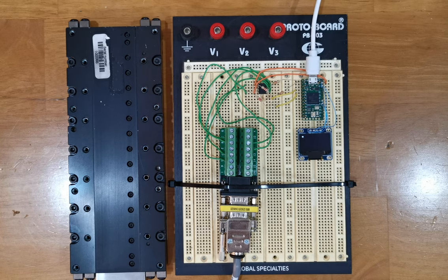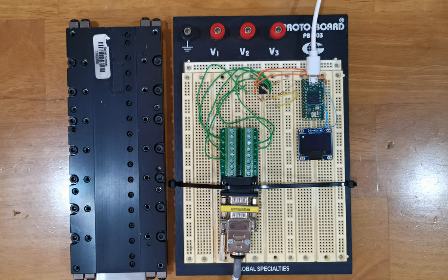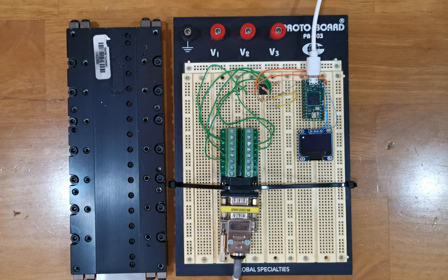We can use the same input stage to test analog and digital differential encoder signals. Or we can use this input stage to take quadrature signal from homodyne and laser interferometers. I plan to do both of these things in the future. But to get the most out of an analog signal, some additional interpolation should be done.